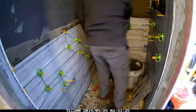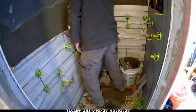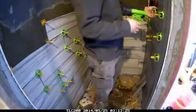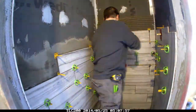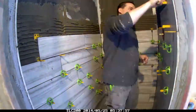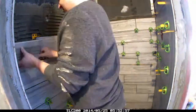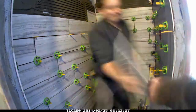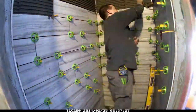This is the shower time lapse — there's not much to say here, I just wanted to show the whole process. It took about three days to lay up this tile. Right there you can see the last point I wanted to make — I used the KERDI drain flashing guard and I sealed it right to the Wedi board with Wedi sealant.